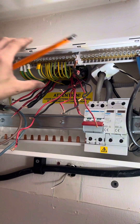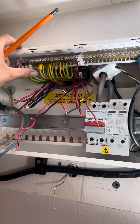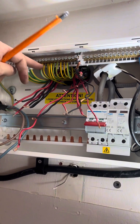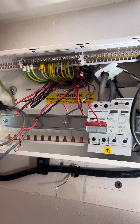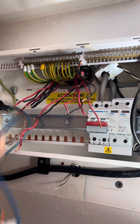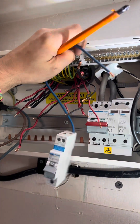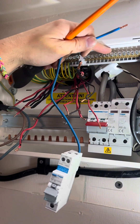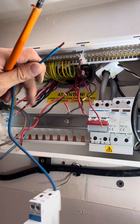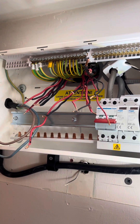Right, CPCs are in, just a little bit of nipping and tucking to do in a minute. Flat blade crimps on the 80/7 — I didn't have any 6mm ferrules so I've got flat blade crimps. I'm going to pop in all the RCBOs now, get all the neutral fly leads in, keep them in there, keep the length, smash them in there, and then run down my circuits — live, neutral, live, neutral — and then we'll do a load of testing.